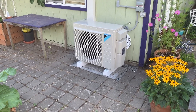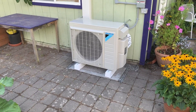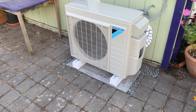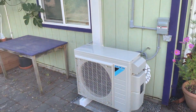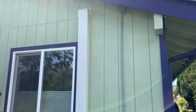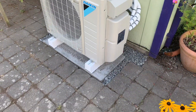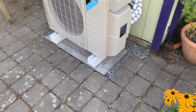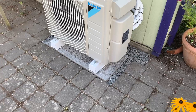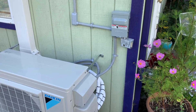We're at the site of a two-zone Daikin ductless heat pump system, and we also have a ducted ductless heat pump up in the attic. Here's our outdoor unit — we're in cooling mode, calling for cooling on both zones. We have six-inch speedy channel because we have two sets of refrigerant lines, one for each zone, running through the attic. The unit is strapped to the building, pad set on gravel — we took the pavers out, tamped the gravel down, then set the pad. We've got risers and a surge protector on the disconnect, as we always do.